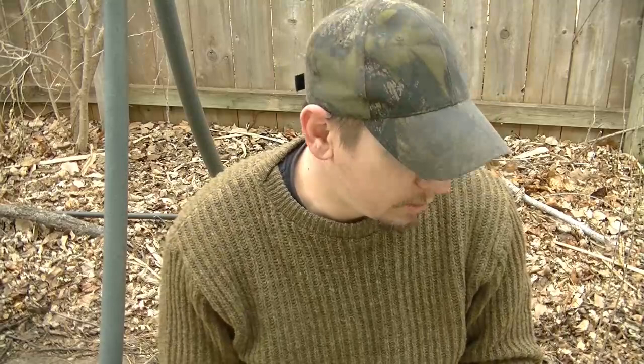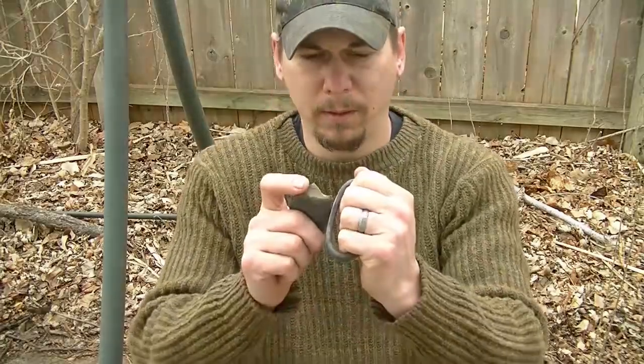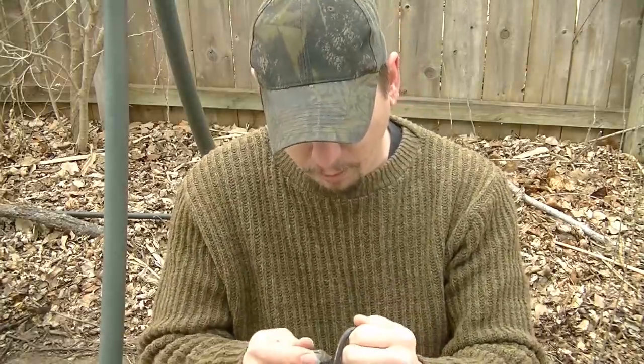That was my new Stanley cook pot that I used to actually quench this in. As you've seen, I probably didn't get the best even quench — I kind of went in at an angle. Like I said, I'm new at this, so trial and error. But let's see if that actually worked. Not really — it's throwing a few sparks, but it didn't work. So let's heat this up, get it back to glowing orange, let it air cool, and then I will quench it in oil and see if that does the trick.